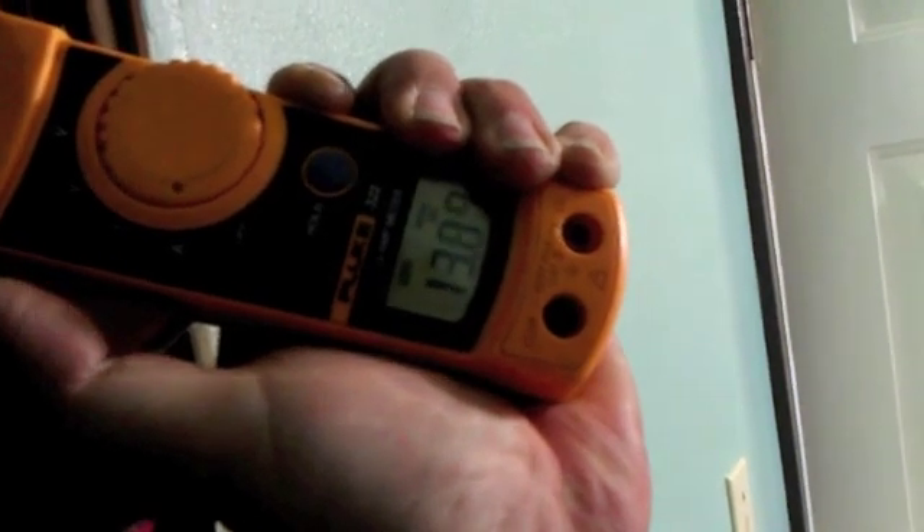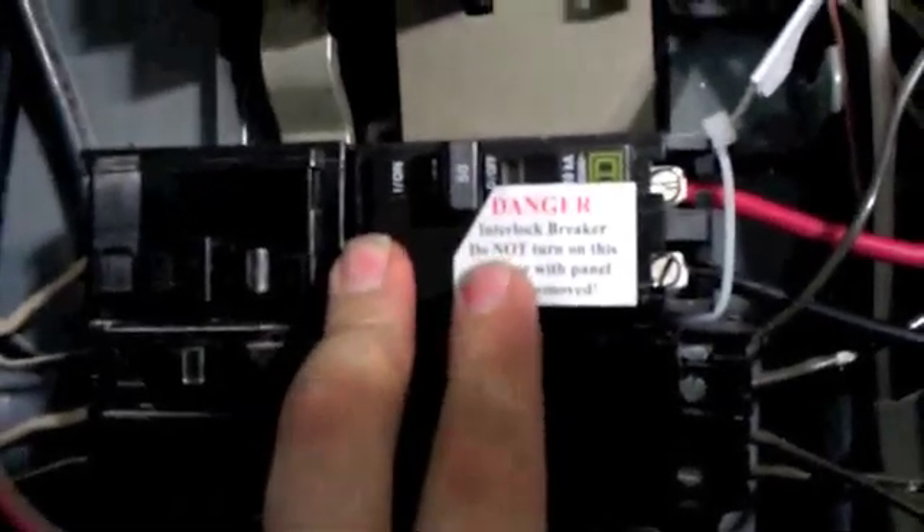Right there we're at 13 to 14 amps. We're back on power company power now and we've gone ahead and rearranged the breakers. We now have the tie strap in there along with a tag that says do not remove this strap. The importance of this is that with the strap on, this breaker will not come out whenever it's under power. Everything's buttoned up in here and we're going to go ahead and put the panel back on and show you how it transfers.